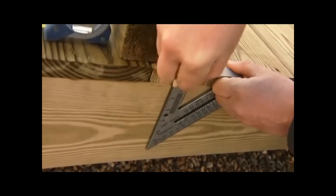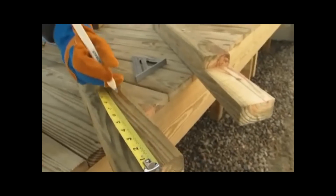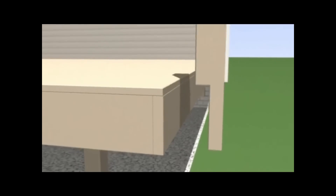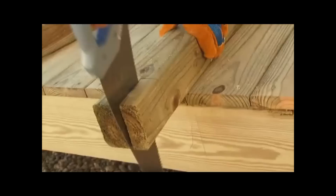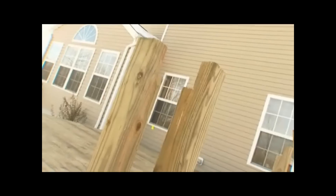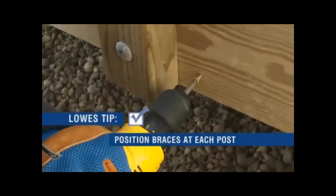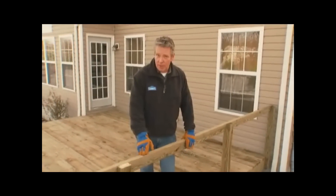With the steps in place, move on to the railing posts. Start by cutting the post to length, then cut notches at the bottom — you'll need to remove the width of the floor joist plus the decking thickness at a depth of one and a half inches. Also notch the top for the two-by-four. Use a circular saw and finish the cut with a handsaw. Clamp the posts in place, make sure they're plumb, drill two holes, and attach the posts with carriage bolts. For extra support along the end joists, attach bracing adjacent to the posts with screws.